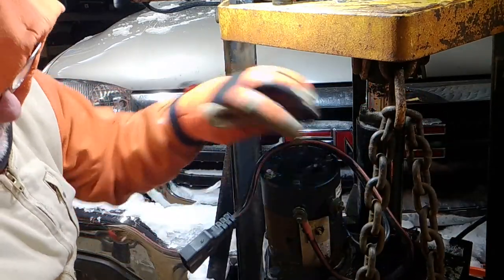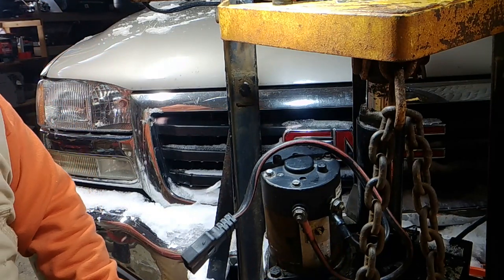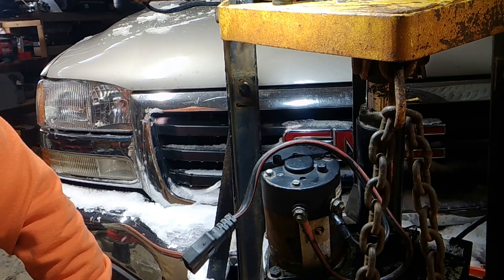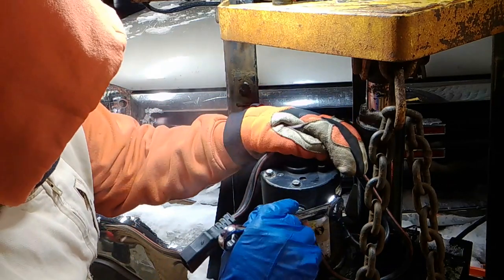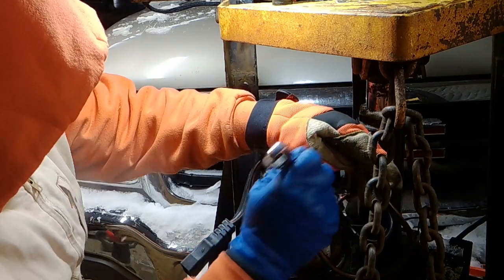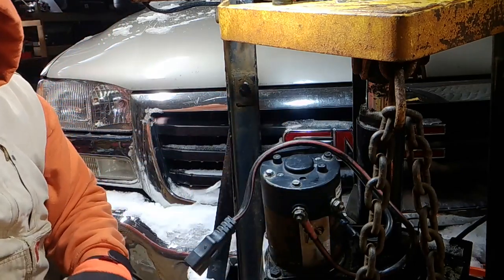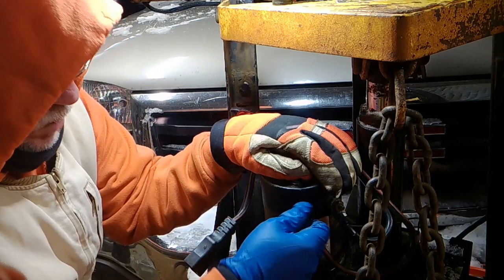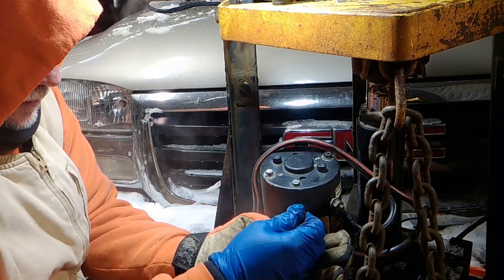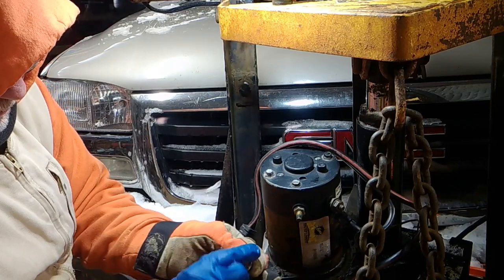Now, I have a ground wire here on this one. I'm going to need a 9/16 box end wrench. It's easy. You can use a socket if you want. 9/16 right here. I'm going to just undo both these wires. Makes my life easier. It's a heavy wire on it. You don't really have to because we're not replacing the pump motor. We're not replacing this motor, the electric motor. We are cleaning the screen on it. I'll show you. So let's just be smart people.